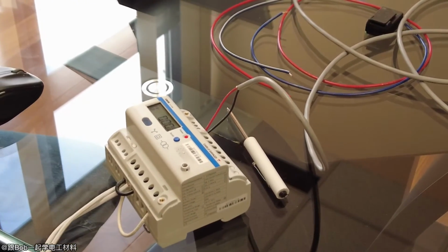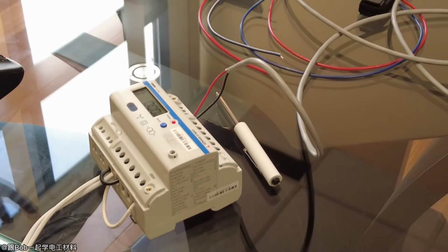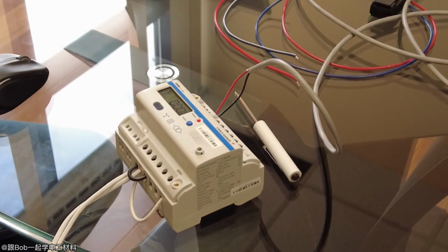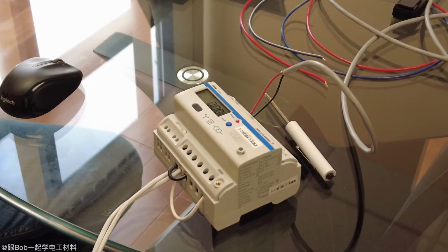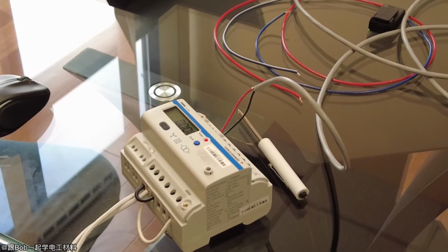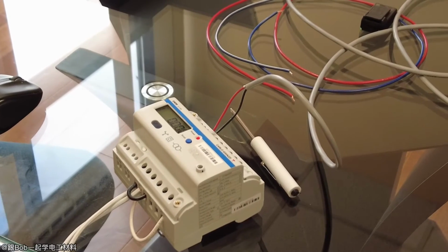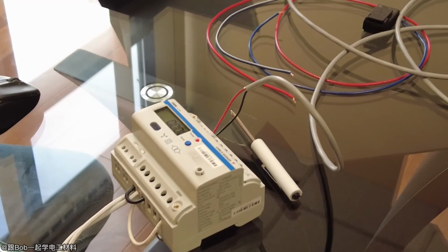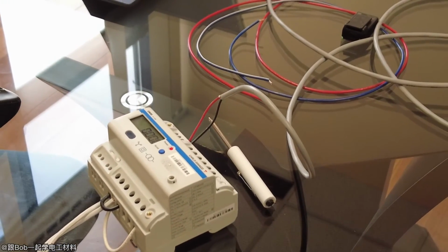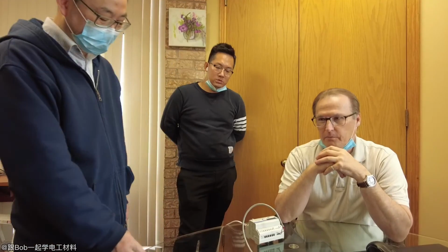With the 10% error. And again, if you want a lower one, you could buy a 250 amp CT with a 0 to 5 amp output. We would probably have that in stock as well. So if you have the 5 amp meter and the guy doesn't want to use a 600 amp CT, we can give him a 500 or a 200, whatever. But again, if you're measuring 200 amps, a 600 is fine. Okay, I can throw it in the box.